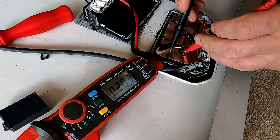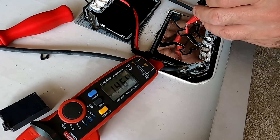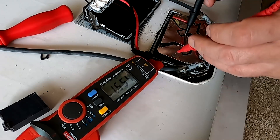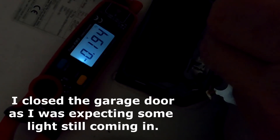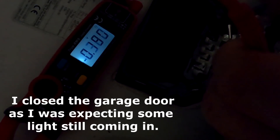199, 206, 203. Interestingly, I can measure something the other way around as well. 1.4 volts. I'm still on the first panel I cracked open and I cannot measure anything in reverse of the diodes, but I can measure something over here on this panel which we just cracked. So does this mean we're already onto something? That's correct, and the other way around is still 1.4. Why is this happening? There should be zero.